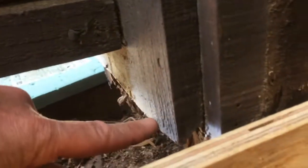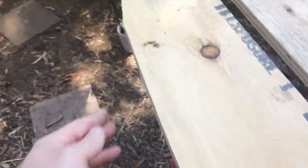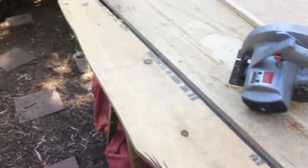And over here, there's a tree root, right? Let's see, maybe it's better. There's this nice tree root here, so I might actually notch the tree root. But we're almost where we need to be. So the idea is to cut the bottom of this board here. There's the existing concrete. I have to cut a little bit there from the bottom of the board. Just get it so that this is level with this. So now we've got a tapered piece with a couple of funny cuts in it, kind of beveled it here, and just kind of cut out around that root.